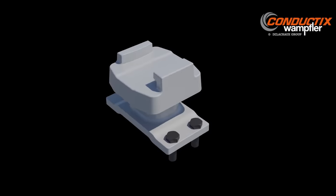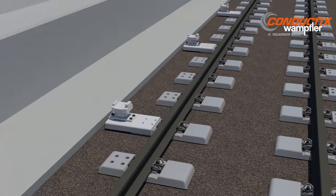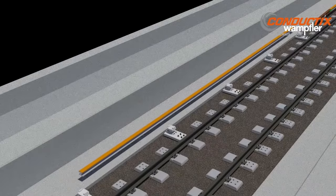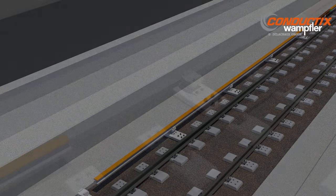Installation of the Aluminum Stainless Third Rail system starts with rugged insulators connected to non-conductive rail tie extensions. Connecting the insulators to this type of extension increases the path to ground, thereby reducing stray current from the third rail.